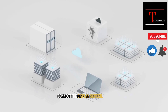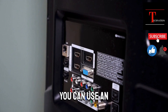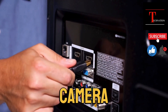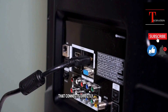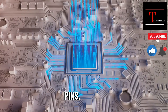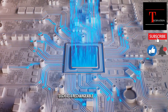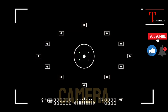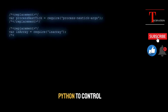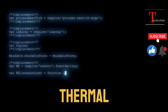Connect the display screen: connect your display screen to the Raspberry Pi. You can use an HDMI cable to connect the camera to a larger monitor or TV, or you can use a small LCD screen that connects directly to the GPIO pins. Power up your camera by connecting it to a power source, such as a rechargeable battery or a power bank. Finally, program your camera to control its functions. You can use programming languages like Python to control the camera's settings, capture images, and process the data from the thermal camera module.